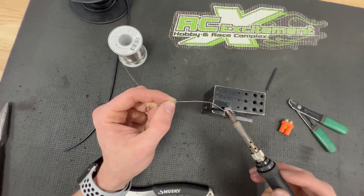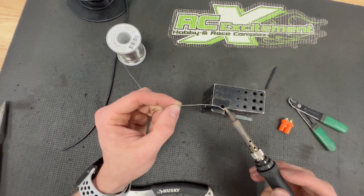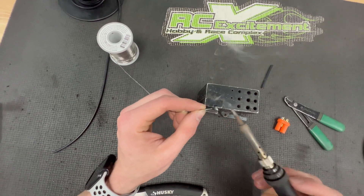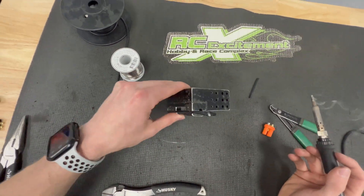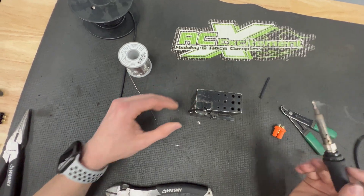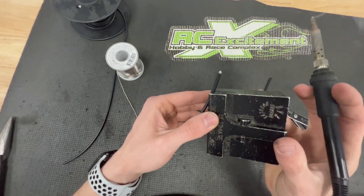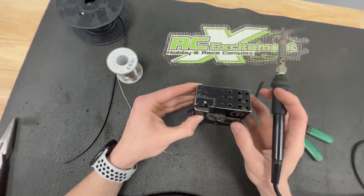I'm going to show you what happens when you do have too much solder, because it is totally okay. So if I start from the back and feed into the front and just feed in way too much solder — because it kind of globs up — all you do is take it and bang it off just a little bit. Then re-add just a touch to make sure everything's nice and full, and then we have a solder joint ready to go.